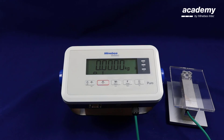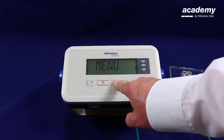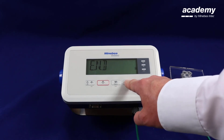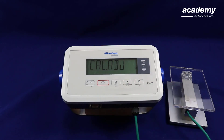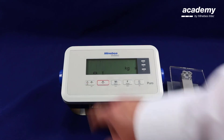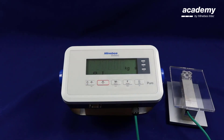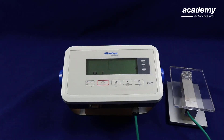We will now show you how to create an error using the adjustment procedure. Press and hold the menu key, scroll up to find the calibration adjustment, and press yes to accept. Confirm the calibration and confirm the zero point by pressing yes. If you do not load the scale and press yes, the calibration error will appear.